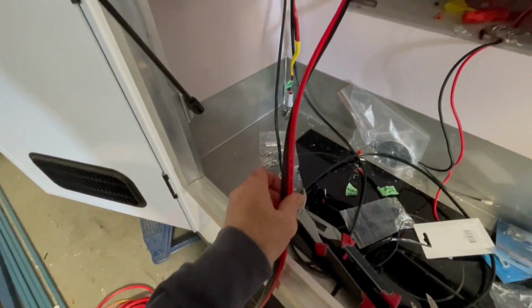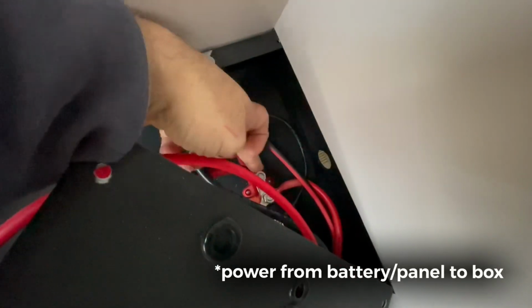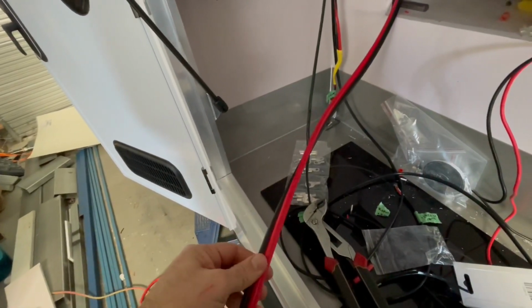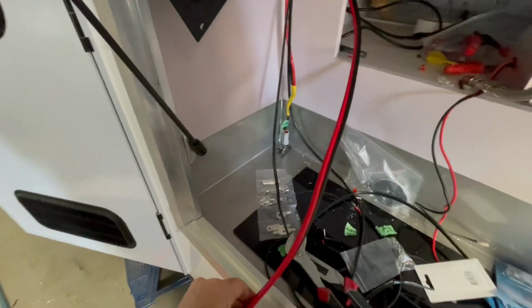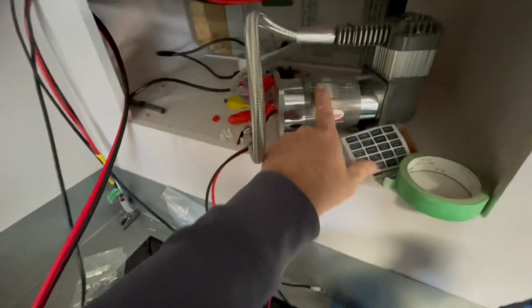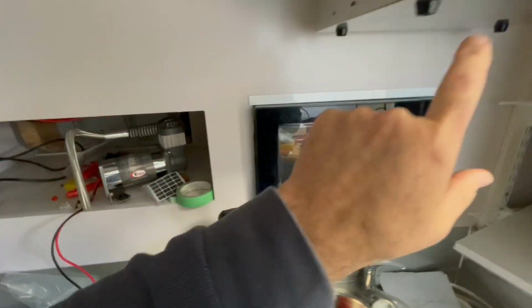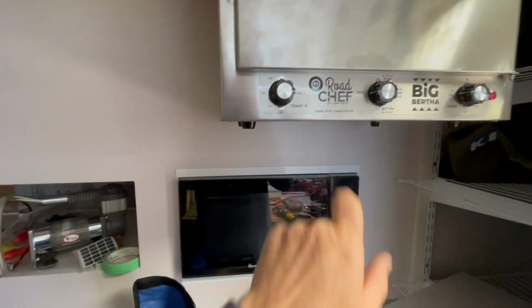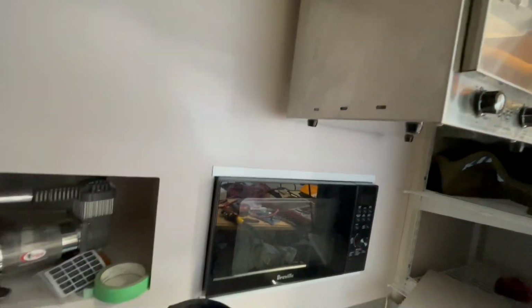And so I've just put a couple of lugs on that and brought it in, dropped it in on the terminals in here. It's got an 80 amp maximum rating, which it says is for up to 300 minutes, or 65 constant. When you add up the things I've got running off it, it gets pretty close, but that's 35 max, and it'll never run at that for a long time, so that's pretty good. I've got two times 10 amp elements in this, so if you've got it on full, it'll run 20 amps. I don't think that's continuous either, it cycles.